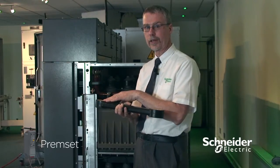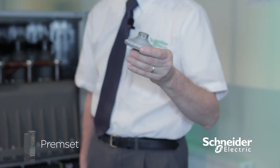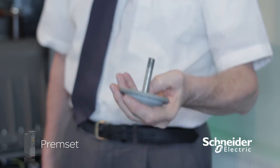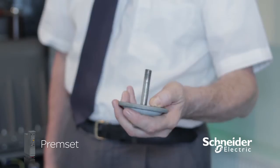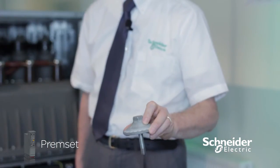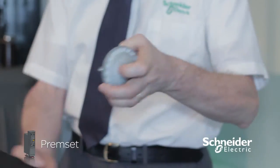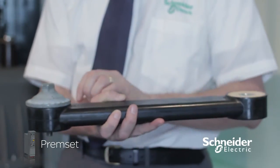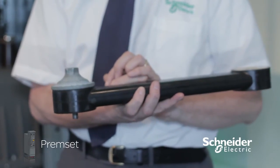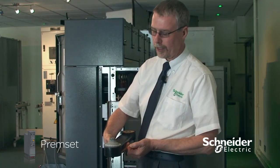And the rest of the HV circuit. Our securing cap comprises two parts: a stud primary contact, then the insulating properties, and then the earth screen properties. Combined with the busbar and bolted onto our vacuum bottle, this will provide continuity on our earth screen throughout the entire HV network.